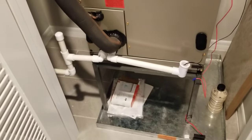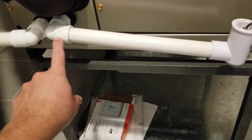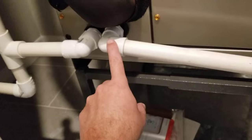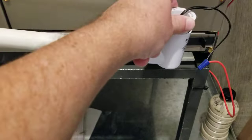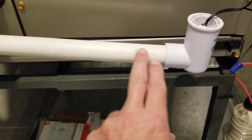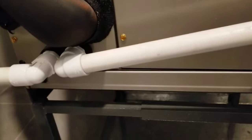So what most likely is happening if there is a drain backup is that a switch has been activated, because water normally, as it leaves the unit, goes out the drain out to the house. This is the backup overflow. If you go ahead and pull this out, you see there's a little float right there. So if water starts to build up, that float gets pushed up and thus closes the switch. Do note that you want this always to be angled slightly downward — that's on purpose. Don't put it up or leave it up like that, because that defeats the purpose and the switch will never be activated and the water will back up straight down.